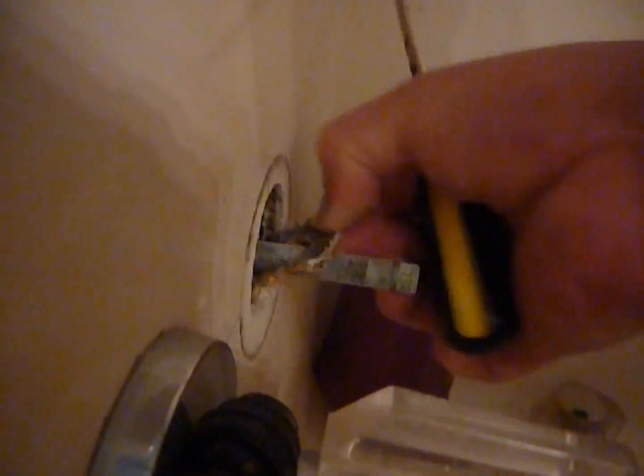Well, as soon as you poke through, you're going to feel the depth of the fiberglass. There are going to be places where it's going to feel like the bit won't go through. It's hitting something else. There's more resistance back there than just the fiberglass. That's because behind this is of course the framing to your wall, and sometimes framing supporting the plumbing. So if you just pull this out, there's the outer layer of the fiberglass, the pretty part we all get to see. There's this stuff that looks like cardboard back here. We'll pull that out too. There we go.